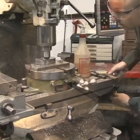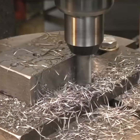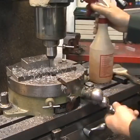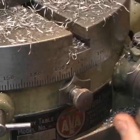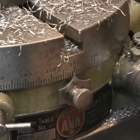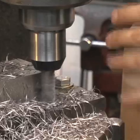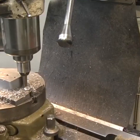Using a finishing end mill, I'm going to use the x-axis feed on the Bridgeport to mill the straight section — the flat section of the part — until I get to the centerline. Then I use the rotary table to rotate the part and mill the finishing pass on the end. I turn the part until it gets to 180 degrees, then use the x-axis feed again to go back and finish off the other side. Using the y-axis screw, we square up the back of the part, and now the outer perimeter is complete.